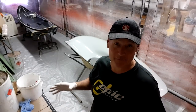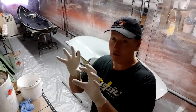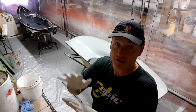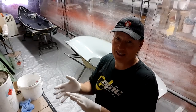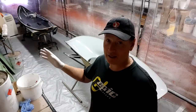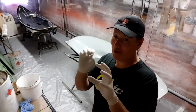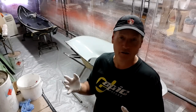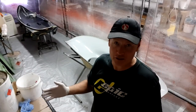It has to all happen in about 5 or 6 minutes too, because you've got one resin going off and another one being blotched over the top of it. And by blotching, I mean I'm actually physically blotching the yellow over the top of the black. And if I'm not careful, I could end up with a lot of brown streaks through it. Now, the majority of the colors we want are bright yellow and bright black. We don't really want that blend, but it does actually create quite an interesting effect, and it effectively emulsifies together to form our finished product.